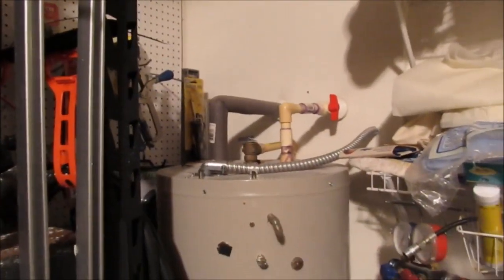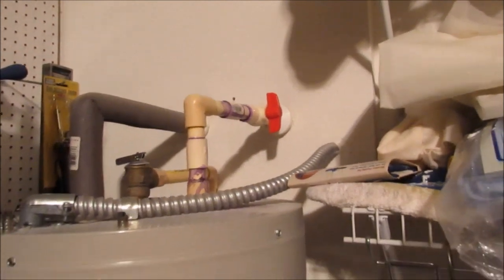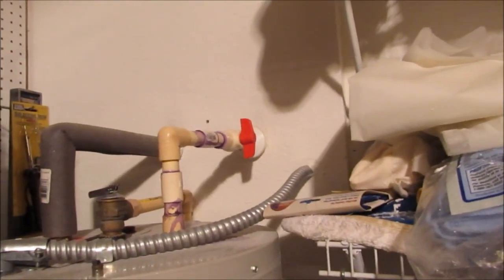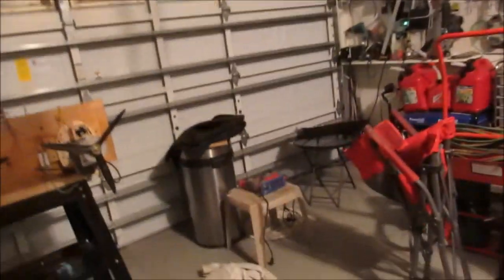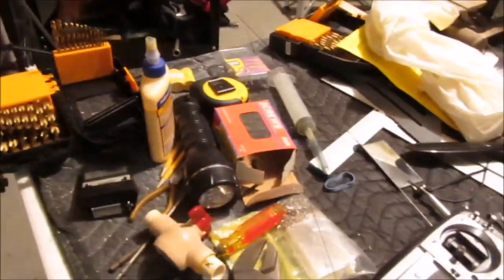You're in my garage now — here's the water heater in the corner, and on the opposite side of this wall is that bedroom. As though I don't have enough problems — this valve was also defective. When I shut this cold water feed valve off to the hot water tank, I would still get hot water through it. So when I thought I was shutting the hot water off, I was still leaking water. Double whammy — a bad gate valve outside that wouldn't shut completely off, and a bad valve on the water heater.